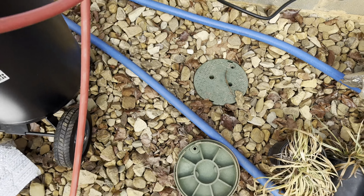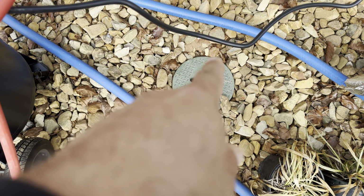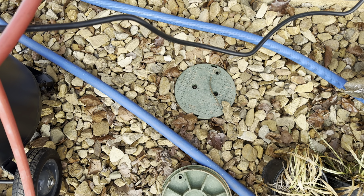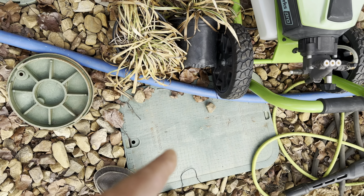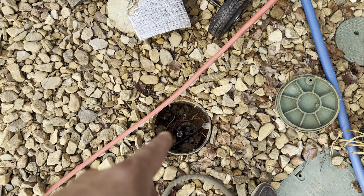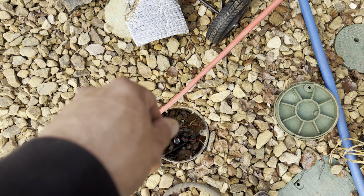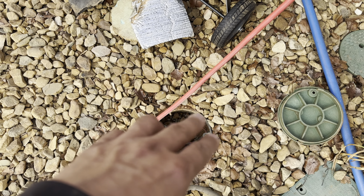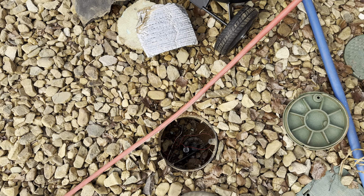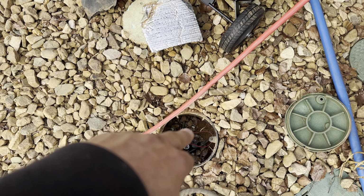So the way I do this is I got a valve that goes to my well. I turn it off. If you got a backflow preventer, if you're on city water, which I got a hookup for that too, it's off. I do have a master valve, so I open the valve on that. The master valve makes all the rest of the valves open up when, you know, you turn a zone on. So I open that valve,